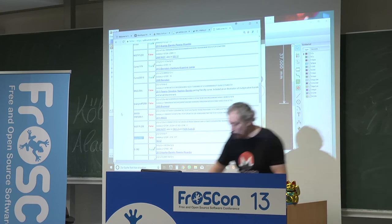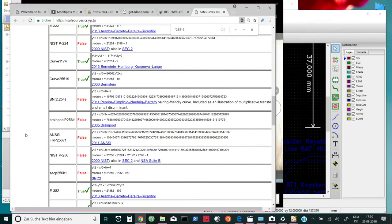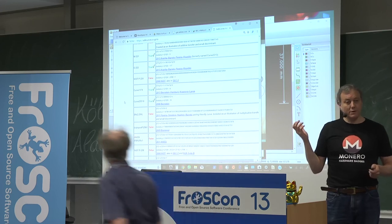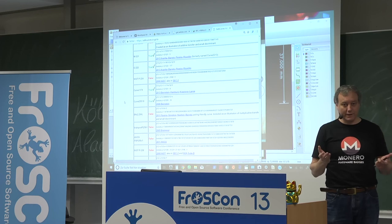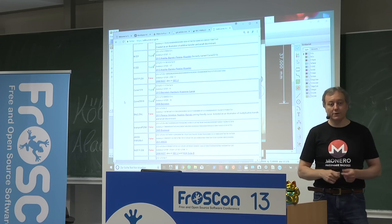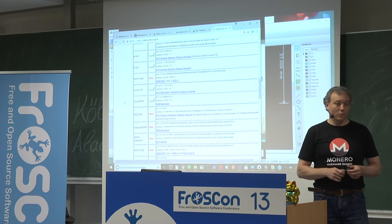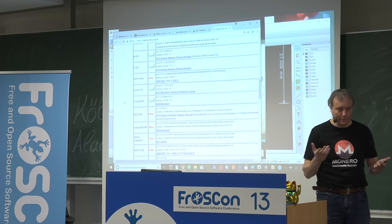If you look at the 25519 variant of the curve, you'll find that he thinks this is a good one. You see that? So that's why we're choosing hardware that supports these curves. It's very particularly important with the secure element, because you're generating secret keys and they need to support the ECDSA curve that your application is using, in our case, ED25519. But other than that, you can do all that you want in software, and you can use this as a YubiKey substitute or anything else.